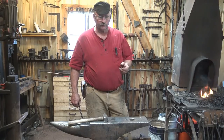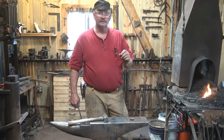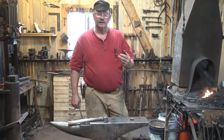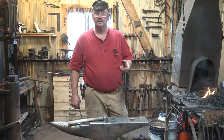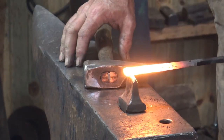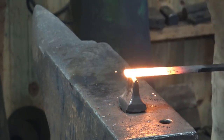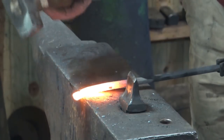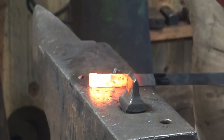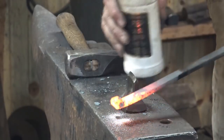For a second version of essentially the same style of snub end scroll — just a heavy end that is kind of rounded up — I'm going to forge weld the end. I'm going to double it back on itself, forge weld it and then scroll it. This should give us just a little bit more mass than we had in the first example. To do this I'm going to set off about a half inch of material over the hardy and cut about half way through. You don't want to cut all the way through. I'm going to bend that back over onto itself and that will be the snub. I'm going to put just a little bit of flux in there, then we'll weld it.